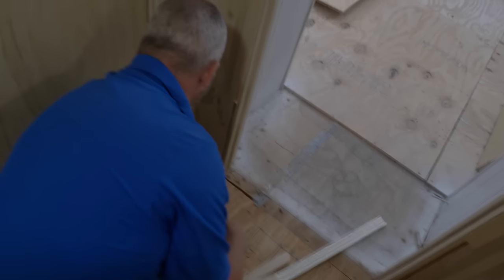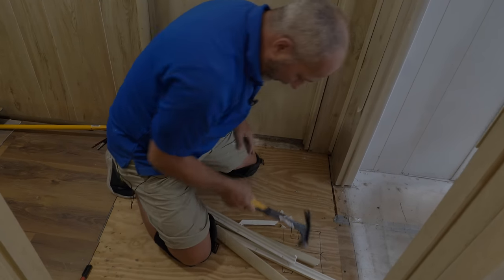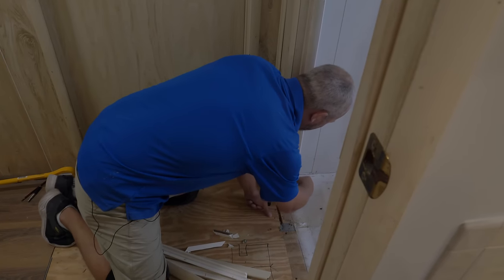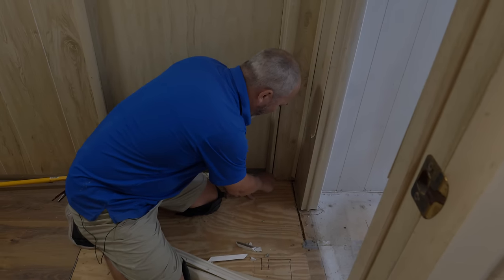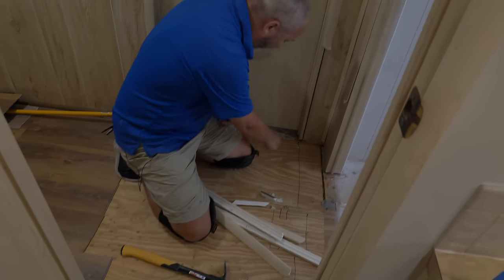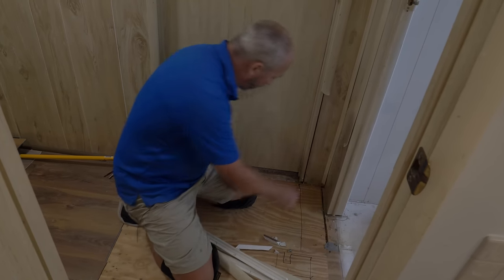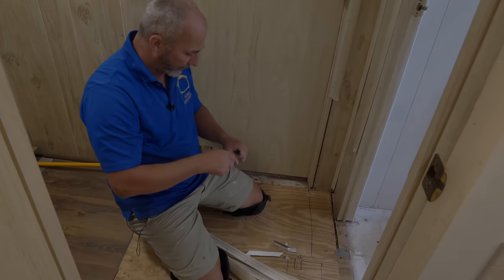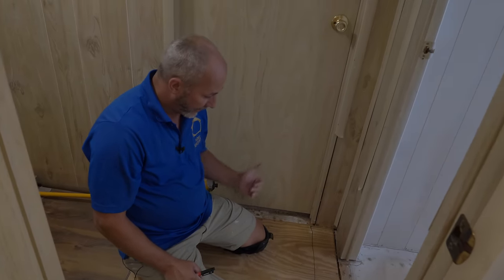Use lots of nails. Once that's done I can measure a piece that looks like this — comes right across the corner, up to about the door. I had to finish this line on the next floor joist which was over here somewhere, but because I'm on structural plywood now I'm going to stop at the door and make my life simple. Come over to this door, do the puzzle piece — this is the proper way to add sub-flooring around existing doors without cutting the jambs out of the way.